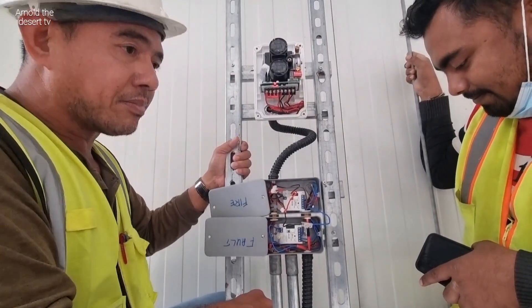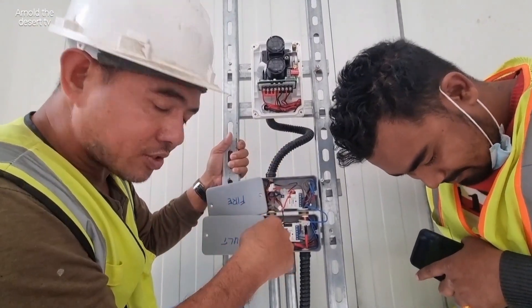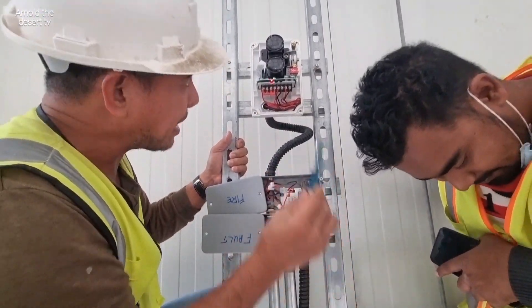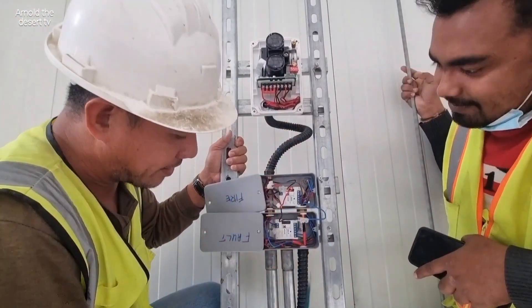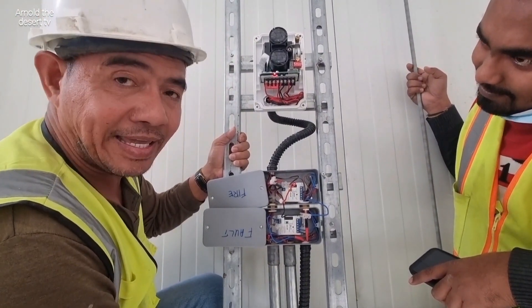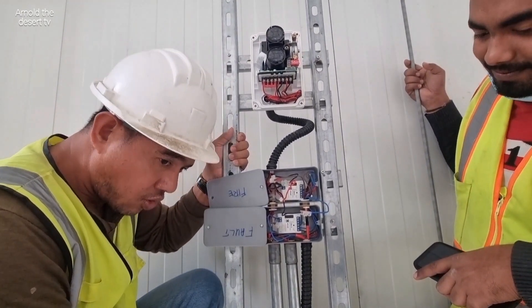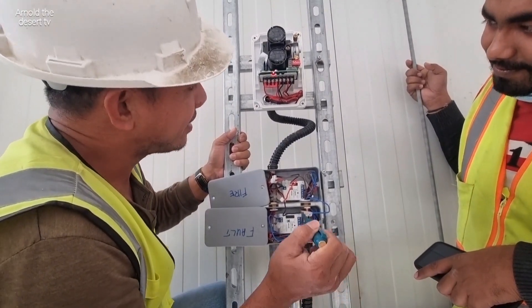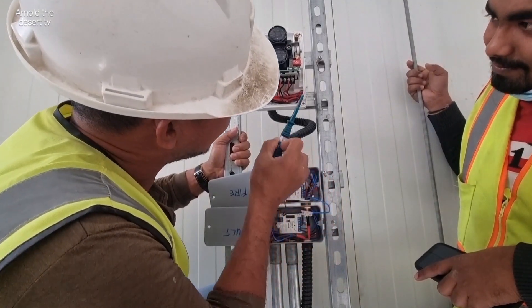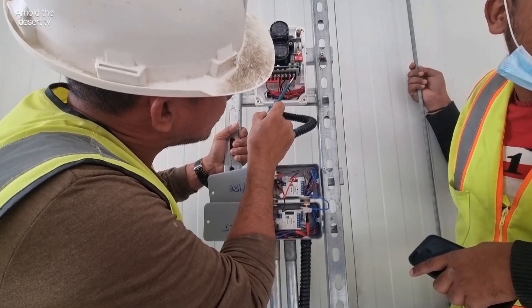One contactor downside from A1 marking A1 A2. So we need power for the contactor. So A1 — this plus coming here, direct go to A1. And minus — A2 is minus. 24 volt minus to A2, coming here, direct to this area — A2.